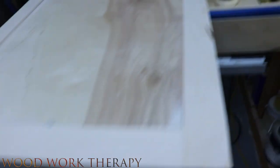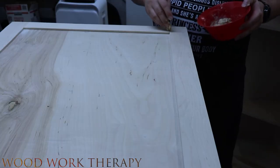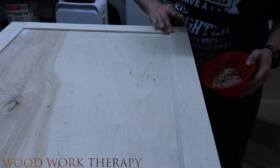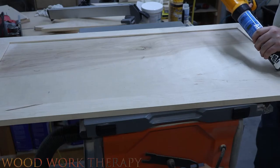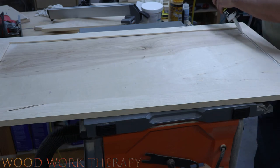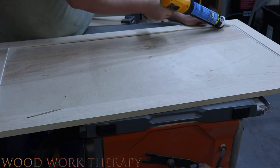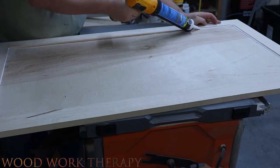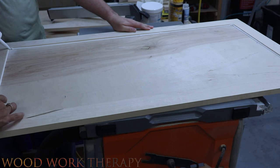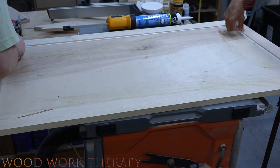Now we look for any deviations or bumps before we go to paint. Any lines or gaps just get filled in with some wood filler — I'll leave a link to what we used in the description. Then go ahead and fill in where the panel insert is with standard trim caulk. It's pretty cheap stuff but your spouse will truly appreciate it. Run a bead down the sides — since caulk is an elastic material it allows the wood to continue to expand — then smooth it out so it doesn't ruin the profile.